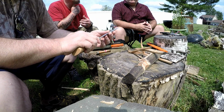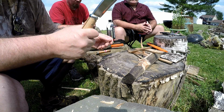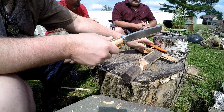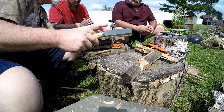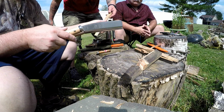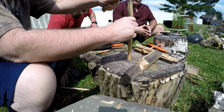And I tell you, that's a very unique edge. That's a chisel grind with the chisel convex on the front. The Japanese do a lot like that. The kiridashis, their everyday carry, little short knife for woodwork and all. They actually have them left-handed and right-handed for your chisel work. But most of them are like that. Flattened back, angled front. And they can be left and right-handed.